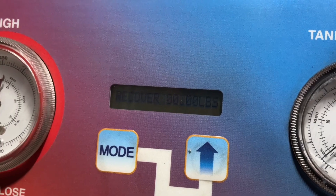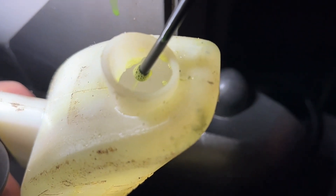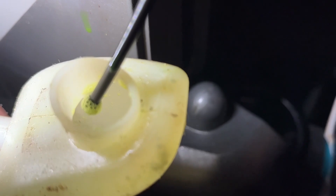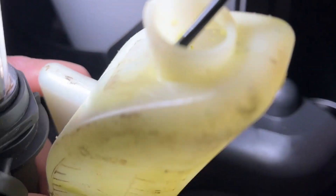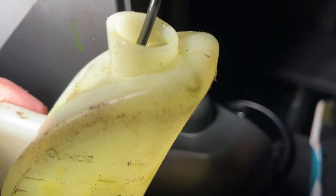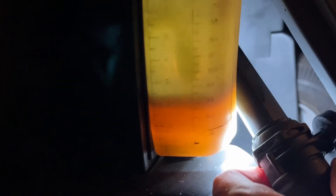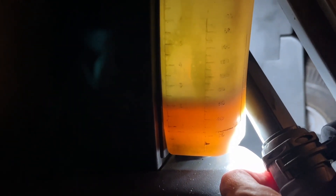Now that I've stopped, it's telling me to drain oil, so I'm going to try that and see what happens. There's definitely oil draining out. I don't know if somebody just didn't do all the oil draining they were supposed to previously. That's about the level we have — maybe two ounces or so that was just left in there. I don't know if that would in fact affect the ability of the compressor to pull a vacuum, but that was what was in there.